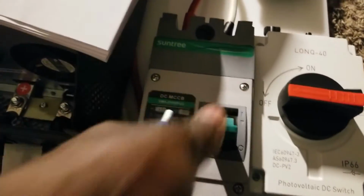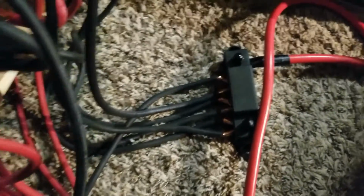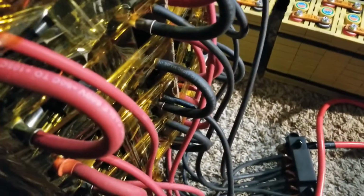Turn off the main battery disconnect, and it's already powered down. The transformer is down, and if we check right now the voltage on these breakers, I set up the batteries to disconnect at 48 volts. So, low voltage cut off. That's why you have that signal. So batteries are empty, and now the inverter is powered down, and we have to do the reverse now. We want to use this machine to charge. We have to use the reverse energy transformer to charge this battery bank, or we can use another device to charge this battery bank instead of going through a reverse process,